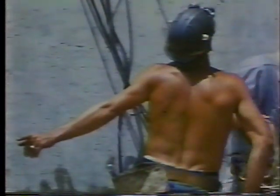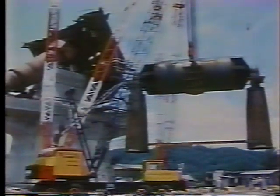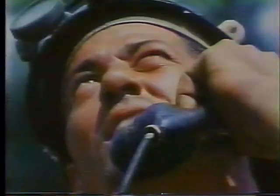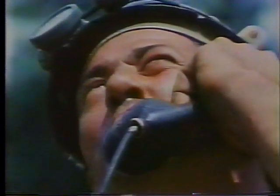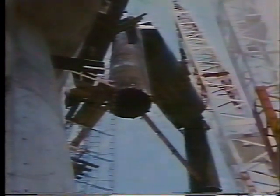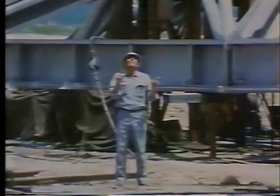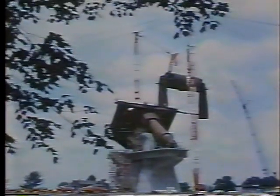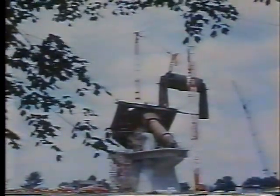With bottom-heavy balance established, the next step is to erect the yoke arms. Both will be erected together, suspended by a balance beam made up of a huge tank 67 feet long and 17 feet in diameter. Both derricks are necessary in this 200-ton lift, which again must be twisted to pass the derrick booms. No other location for these derricks is possible because of the superstructure lift to come, so there are difficulties with the preceding erection.